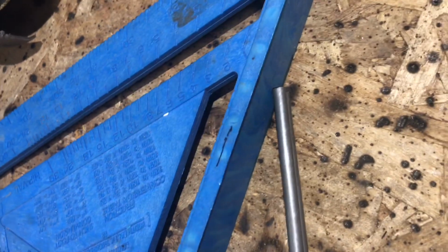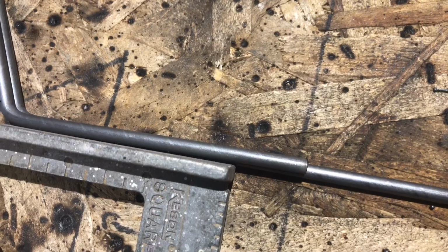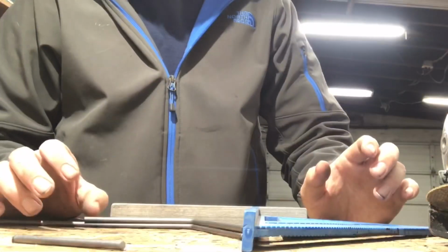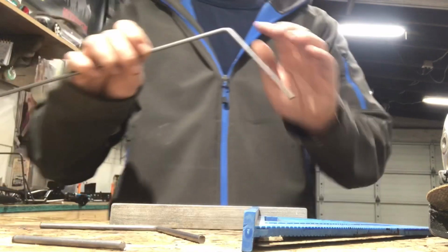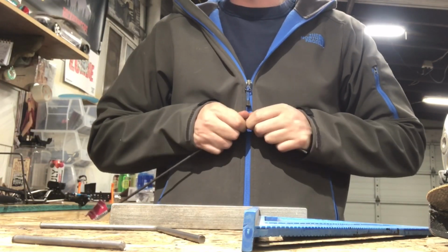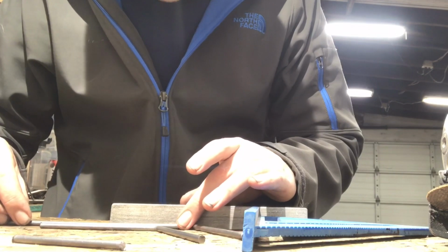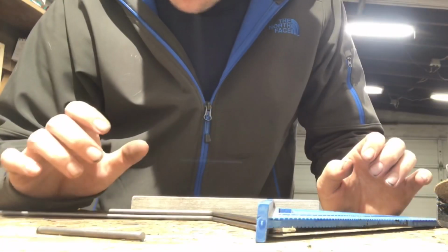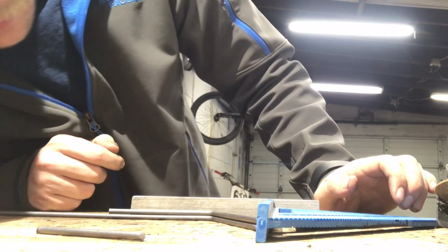So once it's off the vise, I like to do something like this, and I'll make sure the bend on that side is completely flush, and then I'll worry about this side, which you can tell the bend's slightly off because one side's butted against and one side's not. So now that you see where your bend's slightly off, I'll then grab the one I need bent just in my hand, just to give her a slight little different bend. Put everything back to butt it up, lay this one on top. So both tubes are now butted against over there, butted over here, and we're looking pretty good.